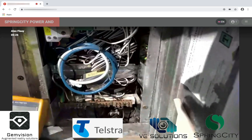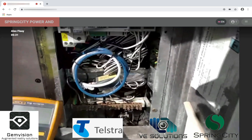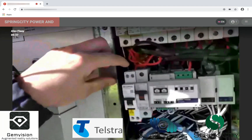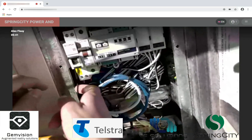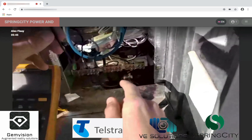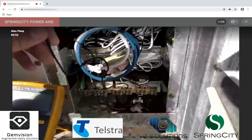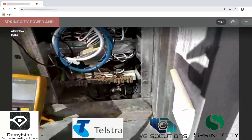Are you able to trace the neutral — the main neutral — from that RCD circuit breaker to the neutral bar? Yep, so it looks like it's this one here. Remembering, keep your hands nice and clear. I've located the neutral wire. Brilliant. I can see it going there. So what we'll need to check — we'll just do a tightness check with the screwdriver. Have you got your screwdriver there?